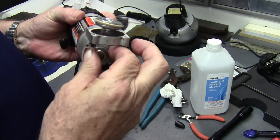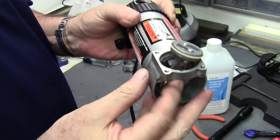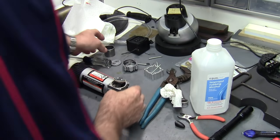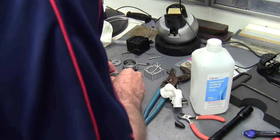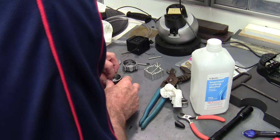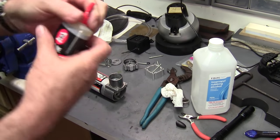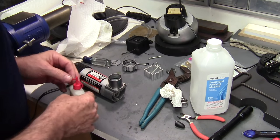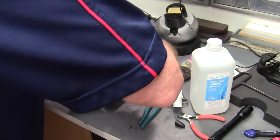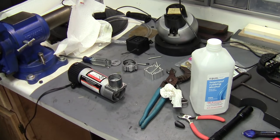The stroke of this is exactly a half inch — a quarter inch down and a quarter inch up. I've measured it, but feel free to measure it again. Put this back in place and I'm going to put a little three-in-one oil right down the sides of it there and there, to replace the oil that I wiped out.